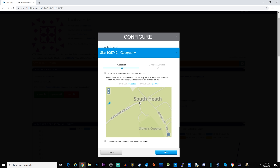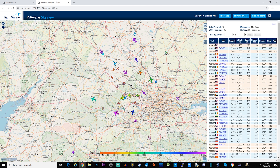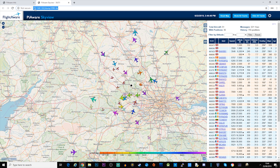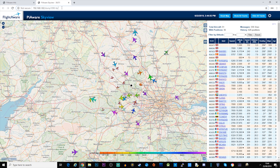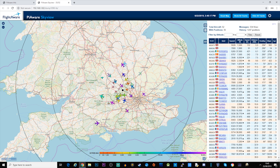If everything is working, you'll see green indicators showing the radio is working, the PiAware software is running, you're connected to FlightAware, and MLAT is synchronised. There's a button that says 'Go to 1090 SkyView Maps', where you can see directly what the PiAware is receiving. The address shown is 192.168.1.82 — that's my Raspberry Pi Zero — and this is live data coming directly from the Pi. PiAware also outputs raw format data, meaning we can use other software to decode and plot aircraft.